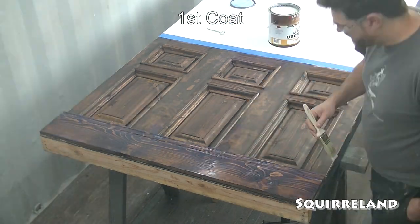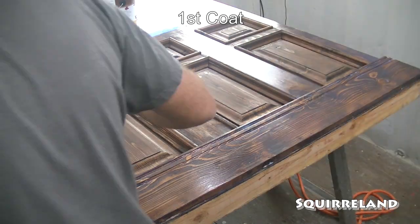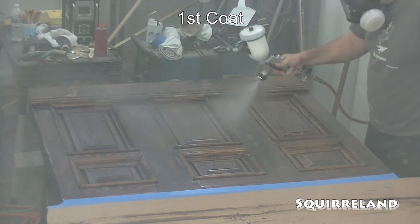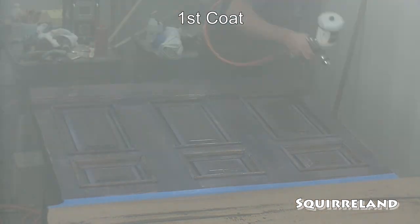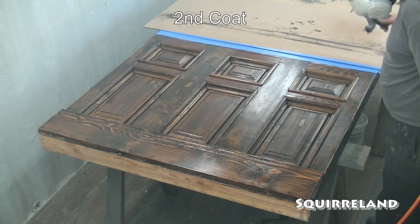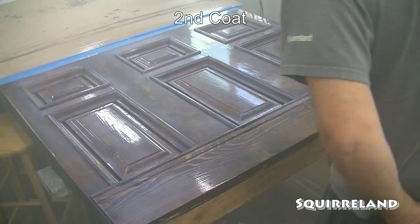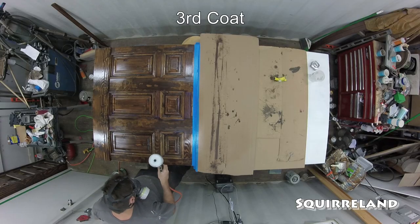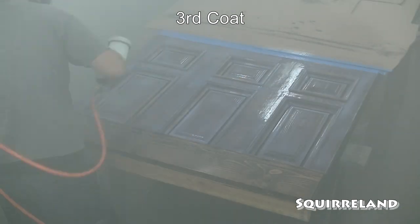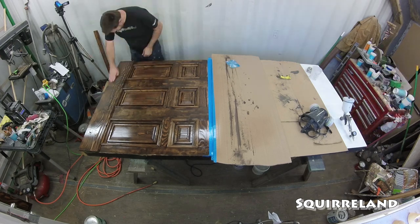I put so many coats of paint on this thing — I really wanted to protect the wood from any potential moisture damage. Now I start using the sprayer. I don't know if I have it set the wrong way, but it really filled up my shop with a paint mist very quickly. I'm really glad I was wearing that respirator. I didn't sand between the first three coats because I wanted to build up a solid paint layer before I started sanding — I didn't want to accidentally sand through the paint and end up having to redo portions of the wood stain. Now that I have a solid three layers of paint, I can start sanding and prepping the wood paneling for the final few layers of clear coat.